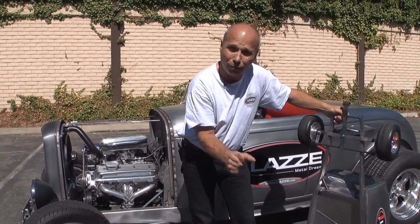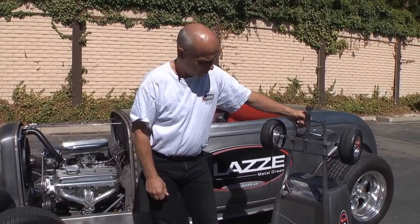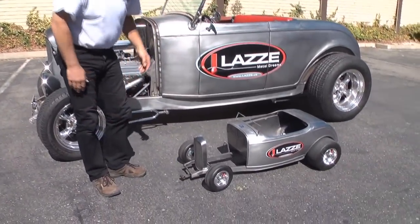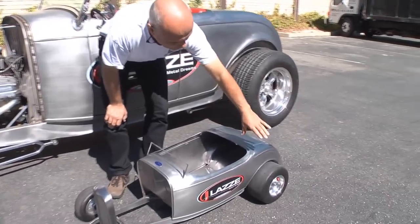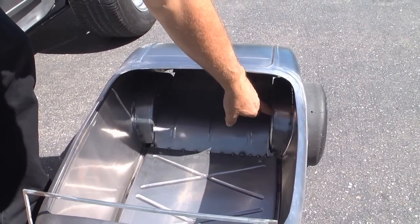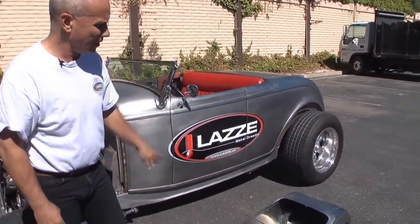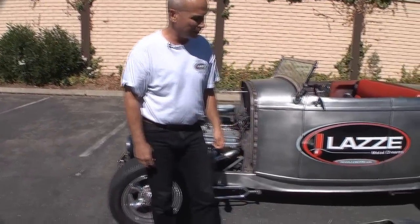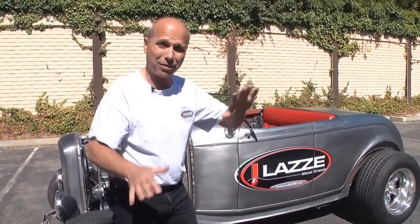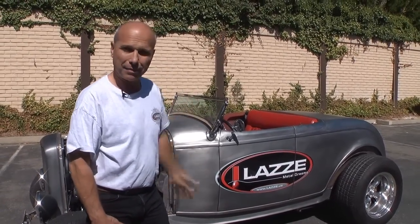You can go crazy with this — you can make hairpins in the front and ladder bars in the back, or all kinds of different things. You can make small fake shocks that look real because you take a small spring, then make the parts in the lathe and a little milling machine. I also tubbed it a little because the wheel was sitting too far out, so I tubbed the frame in the back and extended the inner fenders in the back. Stuff like inner fenders and floor pieces can be done very quickly in the English wheel, bead roller, and shrink-and-stretch. It takes a little more time to get the outside to fit and keep the whole thing symmetrical and not twisted, but compared to a big car, it's much, much quicker.